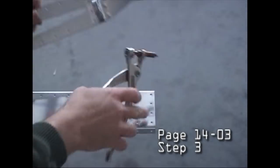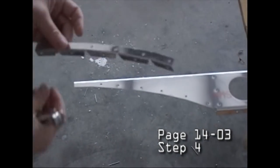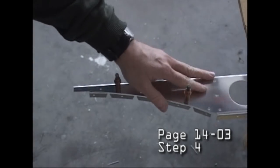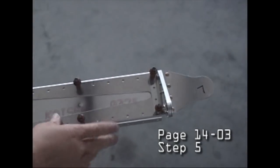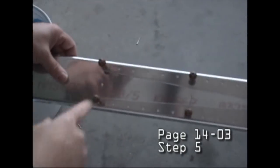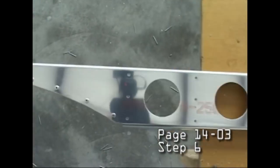And this is the front spar of the wing, and that will be the attach bracket to the fuselage. And there is the tip. And all the holes are drilled, they match up beautifully, so we're just clecoing and then riveting. These were pop riveted in place.